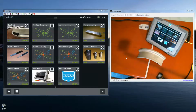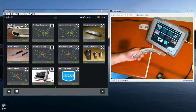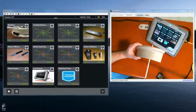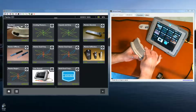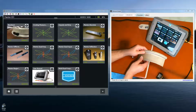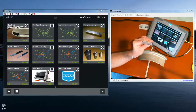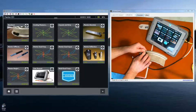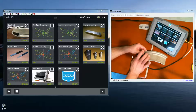Okay, so if we switch over to our view of what's going on at the bench, you can see in the live feed, I have a standard here. It's made from about an eighth or a quarter of a section of wheel itself. And right here in the wheel, I have a tiny little notch. I believe that thing is 3 millimeters long and fairly shallow. I have one of our purpose-built probes, and you can see this probe has a bit of a radius to it this way as well as this way. It's made to fit very neatly in that bead seat and slide along without needing a whole lot of effort to hold the thing in place.